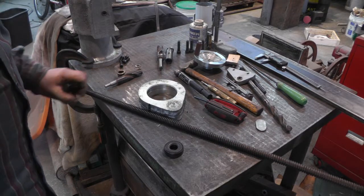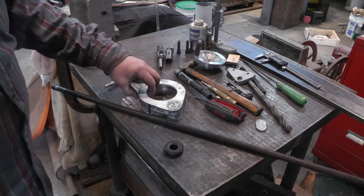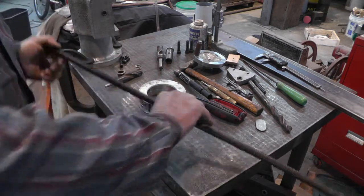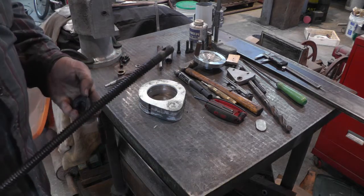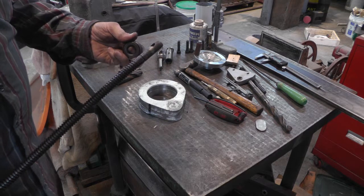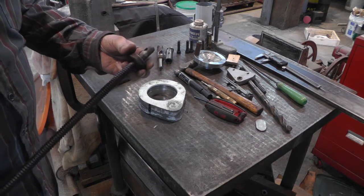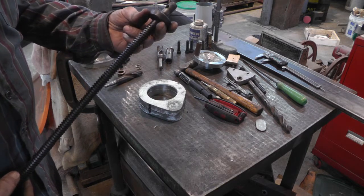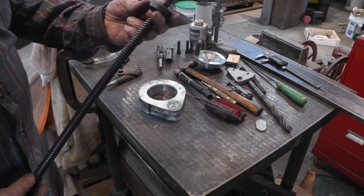Okay, I'm going to get started on this lead screw that's going to be used to raise the head up and down on the column. And what I'm using for that is, I don't know, a lot of you old timers remember them jacks that were like a triangle shaped deal, and they had almost like a lead screw in it. And I saved the screw and the thrust bearing out of an old jack,